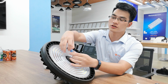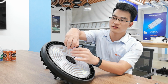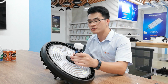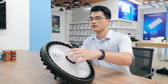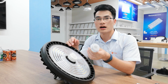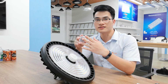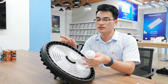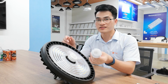So it's unique. Again, we fix the end of the blue cap, and the other blue one we changed, we screw it in. This is for IP65 waterproof standards. And the most important part of our sensors is that both our PIR sensors and microwave motion sensors are 12 voltage input, which means that, although I'm not a licensed electrician, I could install this highbay or change the standard highbay to PIR sensors or motion sensors. So it will work.